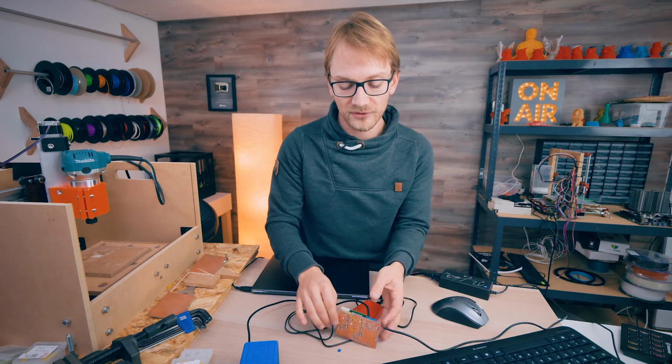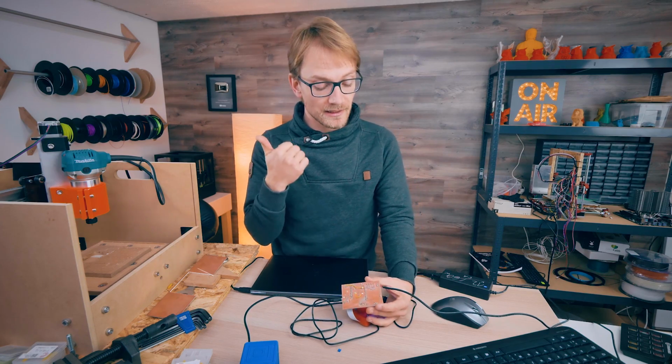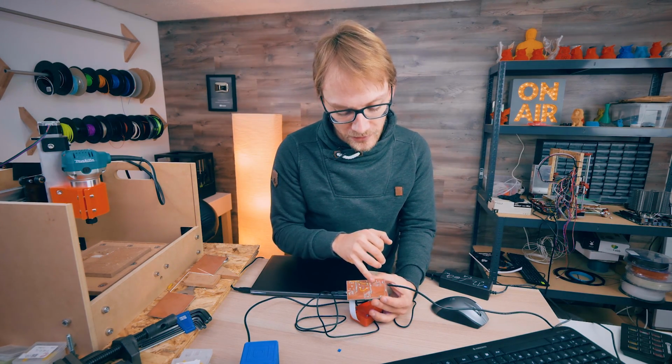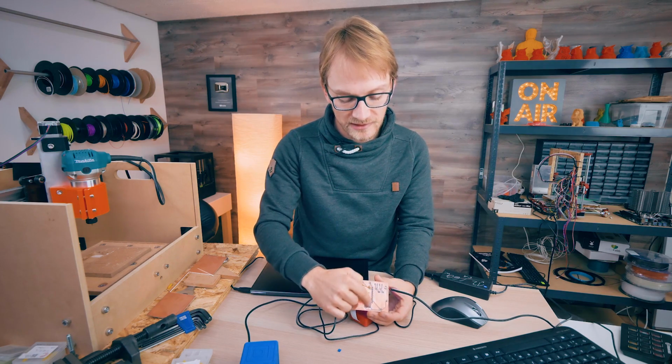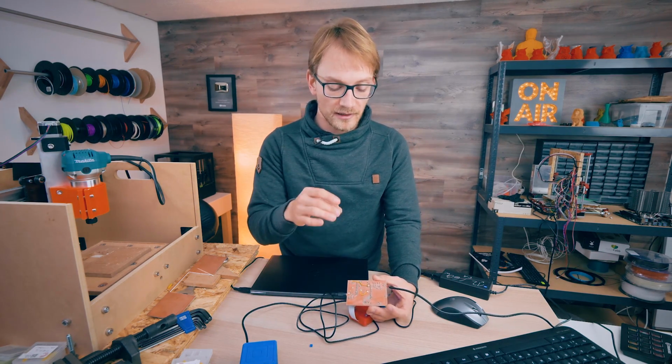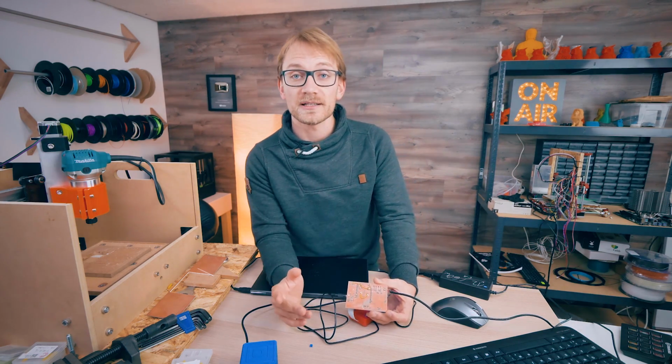It's just a bit limited to what they can actually have in them. So first of all, you need chunky traces. You need like super wide traces relative to what's usually used. The idea of routing traces between pads, so between these solder joints, you can usually have a trace go between them. It's just not really possible with this setup. And basically you just need to set up your Eagle design file or your PCB design file to have large gaps, large isolations, large traces, just everything a bit larger and a bit chunkier.